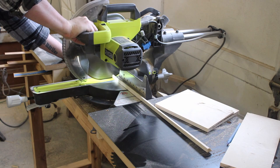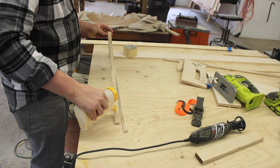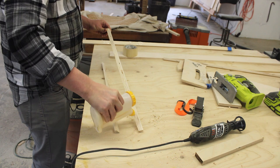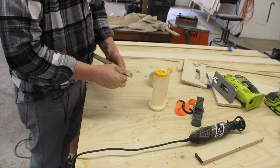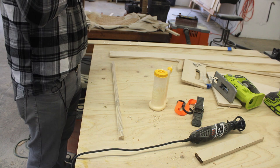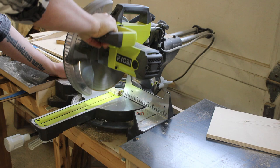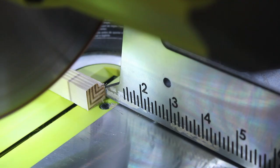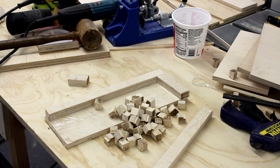In order to do it you've got to cut some plywood — high quality plywood. I picked Baltic Birch because those are the scraps I had lying around. You cut a 45 on one end, leave the other end with a little chamfer, and you glue them together down the center to get a V shape — a really long extruded V. Mike uses rubber bands; I've seen people use spring clamps and blue tape. I had packing tape lying around and it worked just fine. Let that dry at least five or six hours — I did mine overnight — then come over and slice it into one-inch bits on a chop saw.